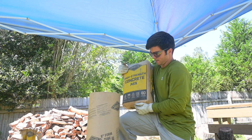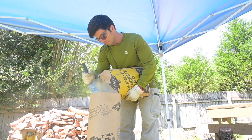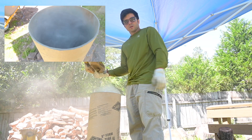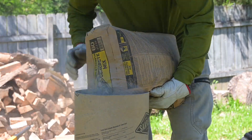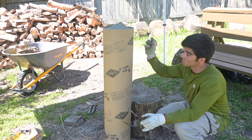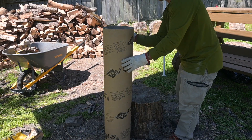We're using 60-pound bags of 4,000 psi Sacrete high-strength concrete mix. Here goes the first bag. You have no idea how much this pains me. Because we poured this completely dry, and usually when you set concrete in, you have to shake it a little bit, tap it a little bit, just to make sure that the bubbles come out, everything settles in correctly.